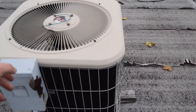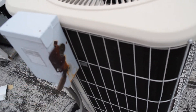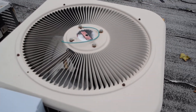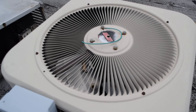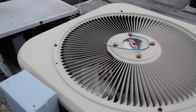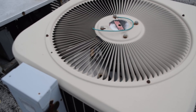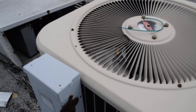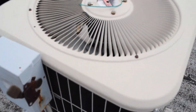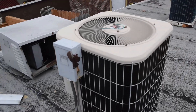This is interesting — I can just shut off the disconnect box and the fan motor shuts right off. Now my theory is that if the compressor were working, I'd be able to turn this back on and there would be a delay in the compressor to prevent it from being damaged, but when I do this, it fires right back up and I do not hear the compressor running.